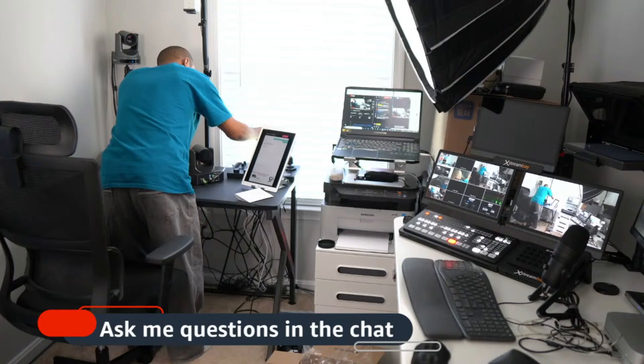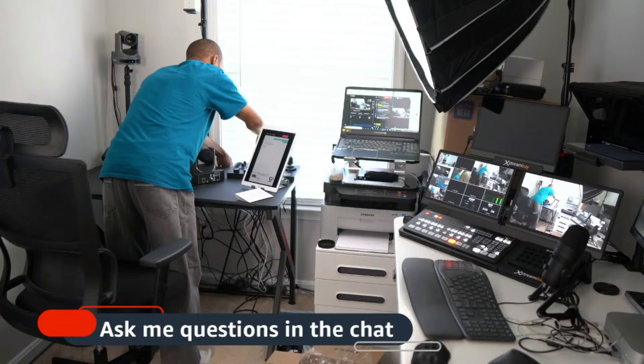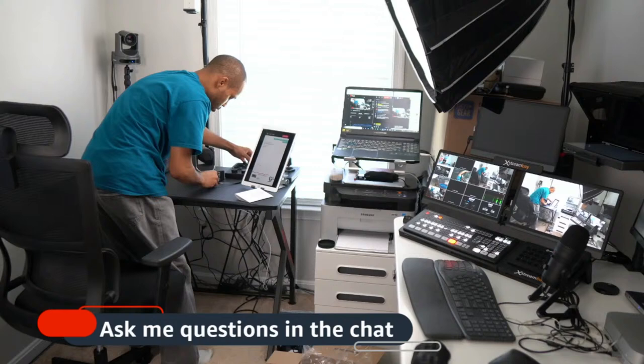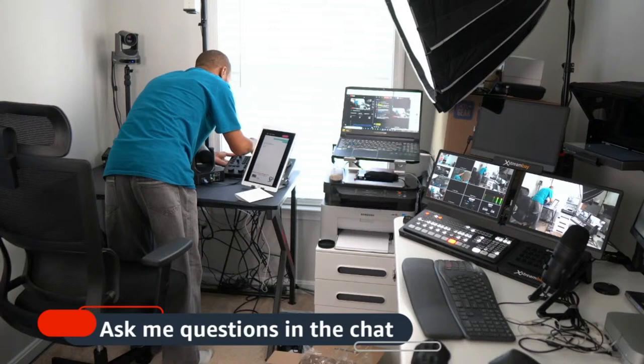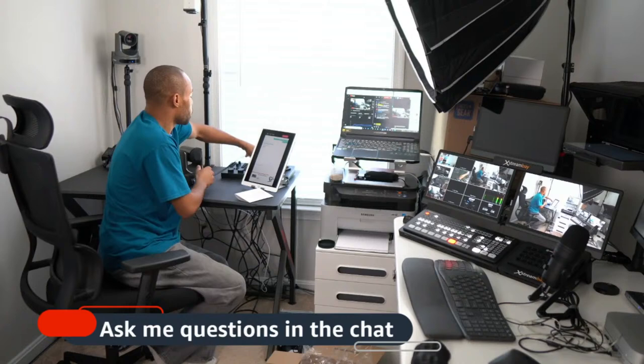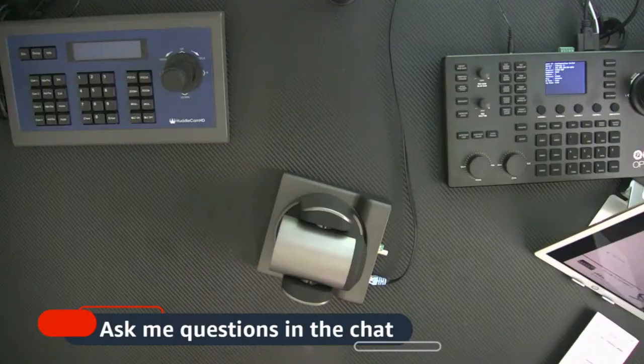You know what I'll do? Since I know I've got that one in the PoE port, I'll take it off my controller. I'll just use regular power for my controller. So let's do this. Okay, so I'll plug that into there, because my controller's PoE too. All right, so I just got the power on, and literally didn't even use my power cable. I just used the PoE port on the switch, and just had the network cable plugged into it, and turned the power button on. So let's switch over to top down there.